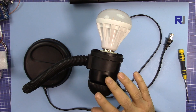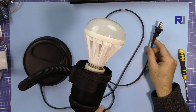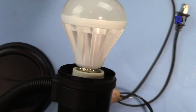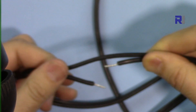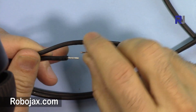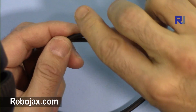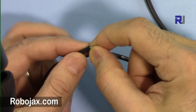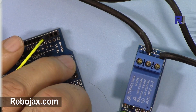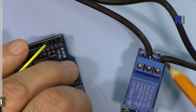This is a table light connected to the wall outlet. I have disconnected one of the two wires. I've cut this wire and now it can be connected to the relay — the relay's job is to connect it so it will be on, and disconnect it so it will be off. I've just twisted the wires and put some solder so they can be inserted into a connector with a screw. I have connected the AC wires between the common and normally open terminals.